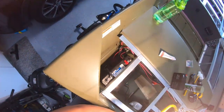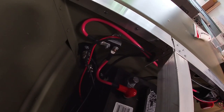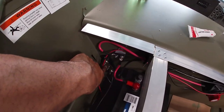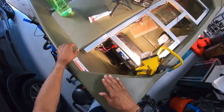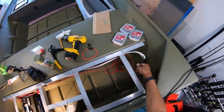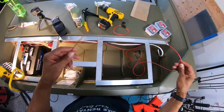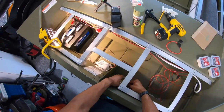Next I'll run the negative wire. I have a negative bus bar back here — I already have things connected to it like LED lights, so I'm just going to tap into that. That limits all the craziness that can happen connecting a lot of things directly to your battery terminal. I have a small four-stud bus bar right back here. I've already run the power wire through the conduit over here for the bilge pump, so all I'll need to do is connect these two together and hide the wire underneath the framing.